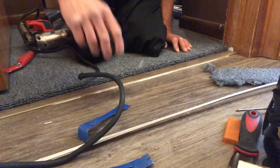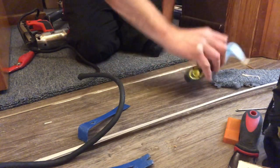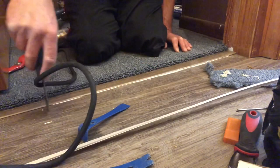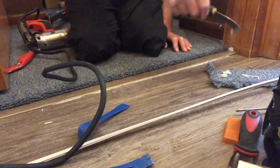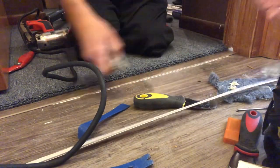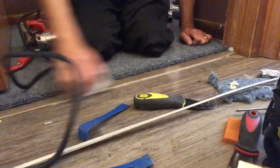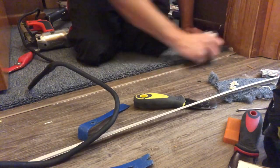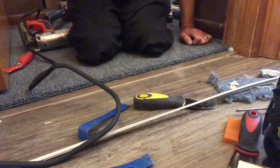Now we've got this glue that oozed up — we're just going to take a linoleum knife and scrape some of that excess up, slop it right on top of a piece of scrap, and wipe it down once we have the bulk of the excess up so we're not smearing it everywhere. Not a big deal — easy to clean when it's still wet. Take a little piece of padding, rub it all into the floor, make it blend in, and bam — that's how you make things happen. Comment below with any questions and I'll see you on the next one.